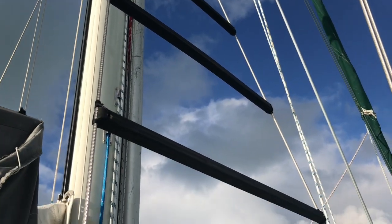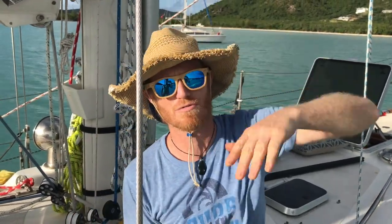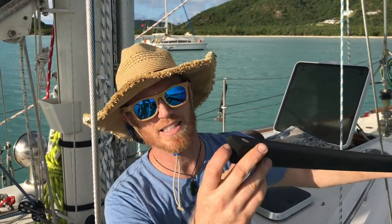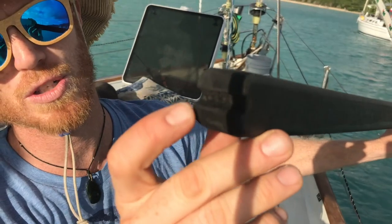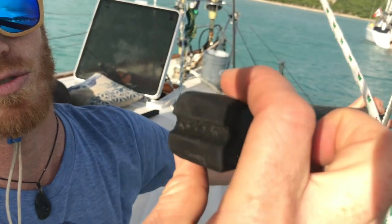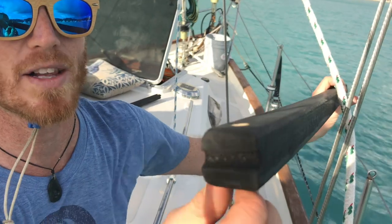In order to determine the angle for your boat — because it's going to be different depending on the style of rigging you have — you're going to want to go and make a measurement of what that angle is. Judge it by the horizon and the angle of this cable in relation to the horizon, and then use that as your guide for how to cut these. The ends were the trickiest part. I had to make a jig with my friend Tim and we used the drill press. We drilled holes that were about halfway through the end, then used a belt sander to round it out to make sure it isn't going to risk catching any lines while aloft.